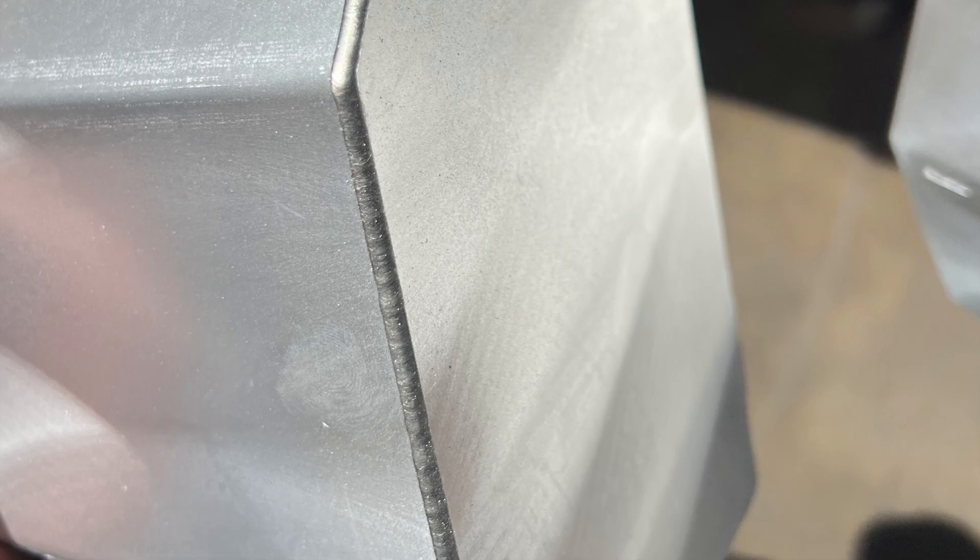You can focus the depth of how deep the laser burns into the material, but penetration is always an issue with the laser — either you've hardly penetrated at all or you've way over-penetrated. It's really hard to control all this. It's a whole different skill set that you need to have when you are laser welding.